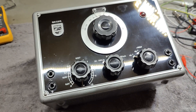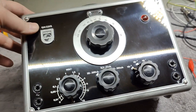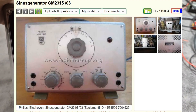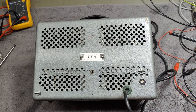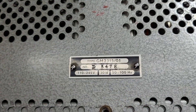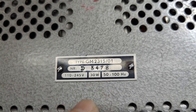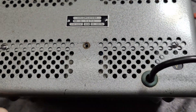This one is of course tube-based and it should contain four tubes. I looked this up at Radio Museum - they have a silver version, and I think it has something to do with the numbers on the back indicating a different version. Here is the back of my unit and it is a dash-01 model, which is probably the older model. It says 30 watts, which is very important information I will use when I power this up.